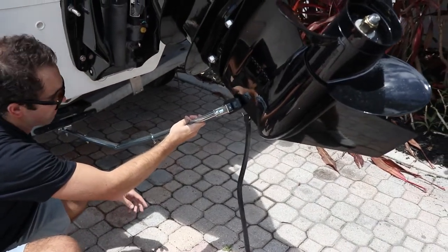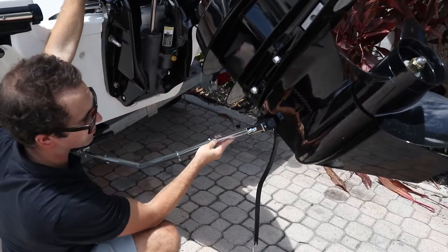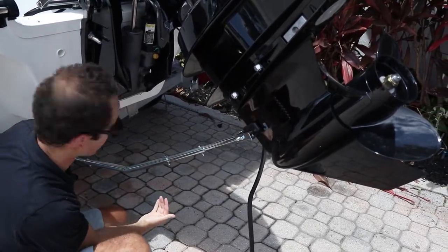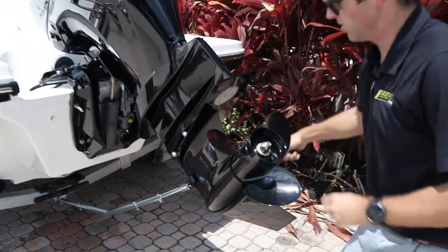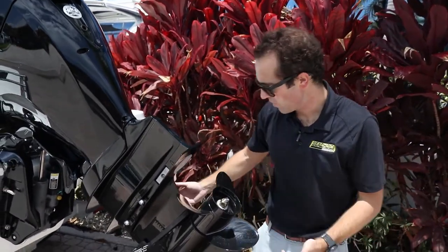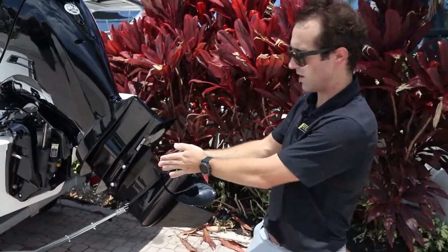This is just about right. The goal of this is to really take stress and weight off of the hydraulic trim. You can adjust the trim down a little bit to where it's in an ideal spot where it almost holds itself, and the weight is pushing through here and getting support off the trailer. We also have a bungee that comes around and acts as a bit of security in case there are any bumps while you're out on the road, giving you that extra sense of security to keep the rubber end onto the lower unit and all that weight getting transferred to the trailer.